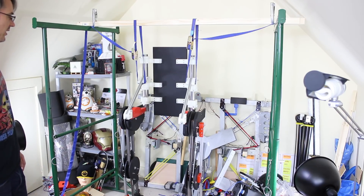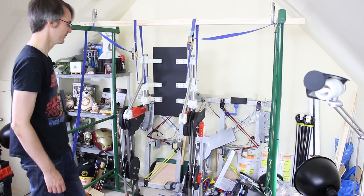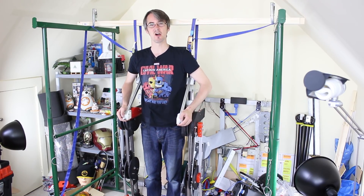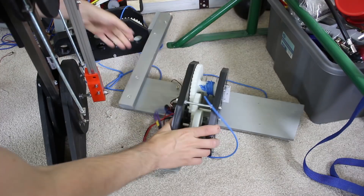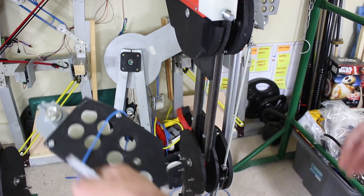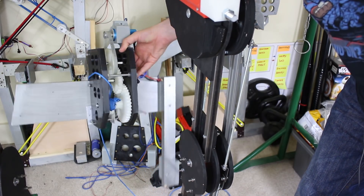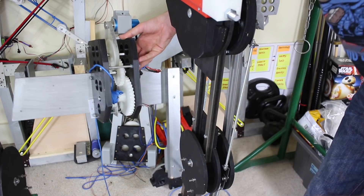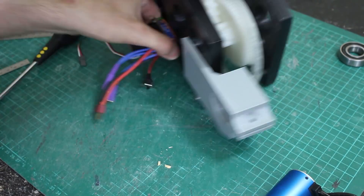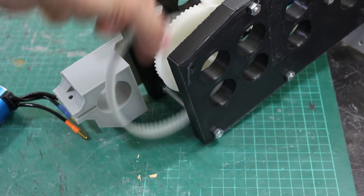It definitely looks better than the Mark 1 suit. Obviously we've got quite a way to go yet — I've ruined my colour scheme with these white parts but I'm not going to reprint them all in red for now. Now I need to clear some of the old suit from behind me and salvage some parts so we can put motors on in the next video. What we need is a load of these blue motors, which are going to power the legs and all the joints. I'm pretty sure I'm going to have to redesign the gearboxes because they're absolutely massive compared to the legs, and we need to fit two of these in each leg now. We could just about fit that on there but I think I can make it much smaller because of the huge gaps in here — we can definitely make these gears smaller. For now I'm just going to take all the motors out. I'll need these drive belts as well but I'll leave them attached to the motor for now and see what we've got.